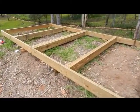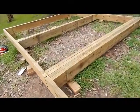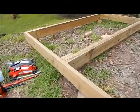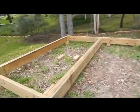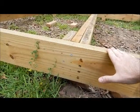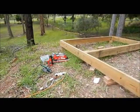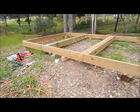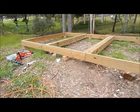That part of the build is now complete. We've got all our doubles on, there's our centre with a big thick piece. For the full-length pieces in the centres, I ended up screwing in the ends as well just to give a bit more stability and make them part of the frame. I just clamped it together as I said before. This will now give me a chance to measure up the heights — there are all different varying heights, so I've got to measure up for making some stirrups, dig some holes, put some concrete in, and have the stirrups hold it up off the ground rather than these blocks or bricks.